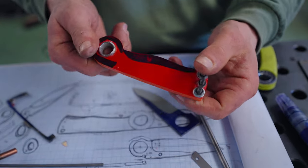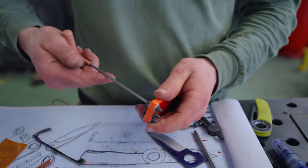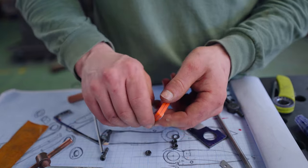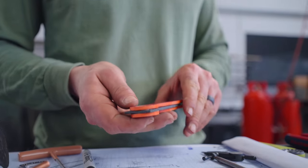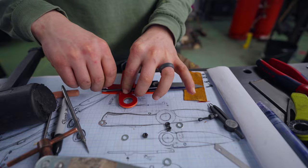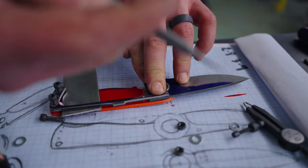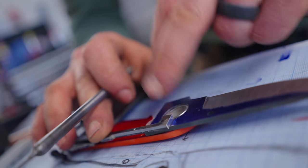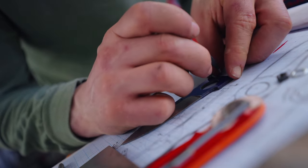The profile of the scales is all complete. The little bit of tube was in there purely for alignment purposes — that isn't the final pivot — but I think I can go ahead and disassemble this and use the opportunity to plan, finish, and refine our mechanism. I love how the handle feels; it's a real improvement over the Petzl version. First, that end needs to be flat — it's currently like the end of the bar. I'll scribe a line for where the cutout needs to stop, and then use the central hole as reference to scribe the new diameter the blade end needs to be made to.